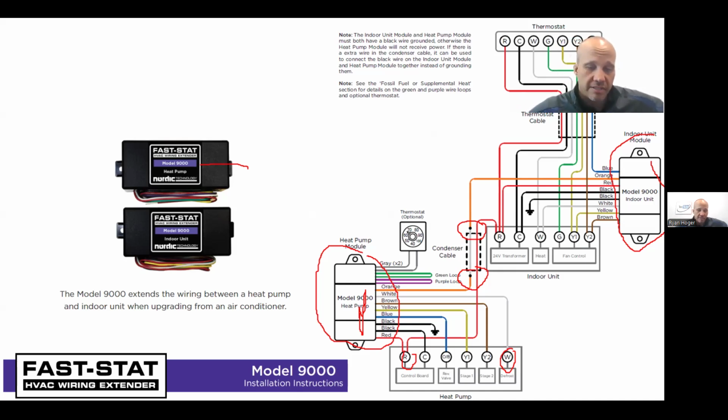However, if they have a 410A system, we've been using these for 20 years. Even though he's only been selling them for like 2 years, we've been buying them from someone else and using them for a long time prior to that. So they work pretty well on R22 and R410A heat pumps, but I would avoid their usage on R454B and R32.